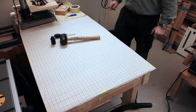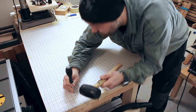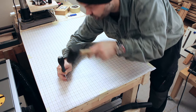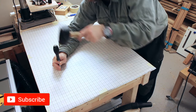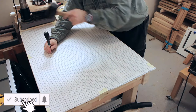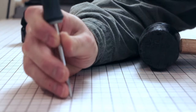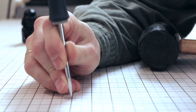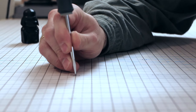It was now time to bring out both my awl and Baby Vader to assist with some real precision work. I am marking each hole with my awl to have a point for the tip of the Forstner bit to register into. While being as precise as you can with the awl is good, it is far less important than the fact that we are using a precise pattern — I made another video all about this, and you will find a link in the top right corner and in the video description.